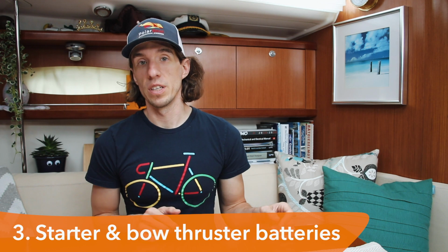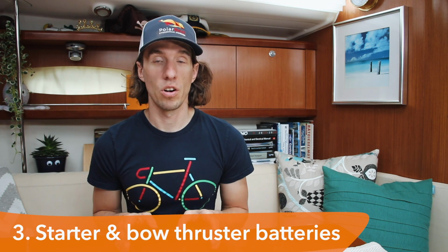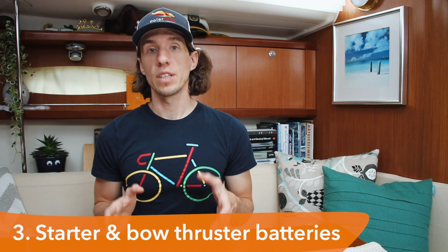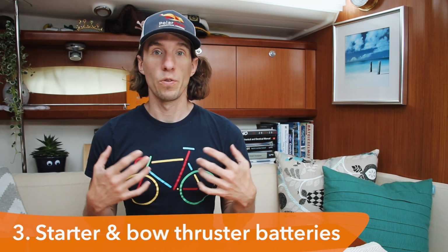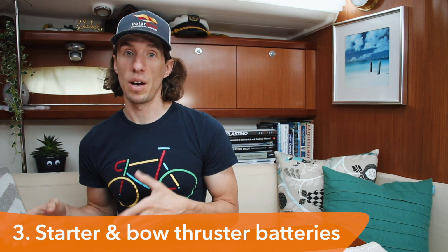There's two reasons for this. One is that we had already just replaced our bow thruster batteries and our starter batteries with lead acid. The second piece is cost. You're only using that starter battery and those thruster batteries a very small percentage of the overall time that you're on the boat. So for us, there's not a big cost benefit for replacing the starter and bow thruster batteries